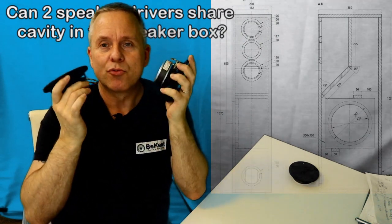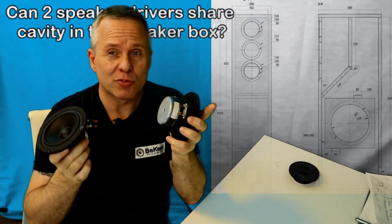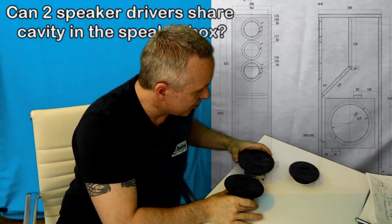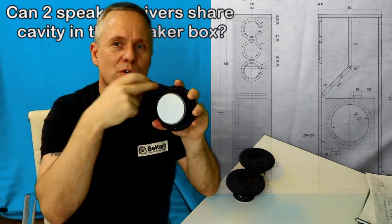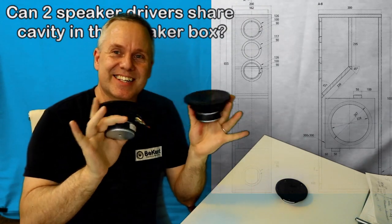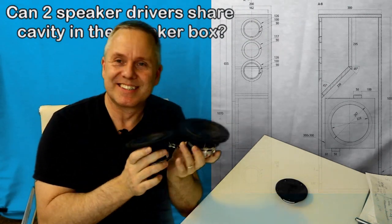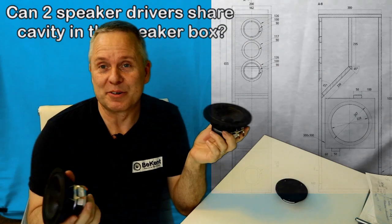So to wrap up: most importantly, if drivers share a room let them be the same model. It's really important not to mix woofers together, and if you're going to have a mid-range and a woofer, the mid-range must be covered so the woofer doesn't start driving it. If you have a tweeter, which is typically no problem, you still need to check the back and see if there's a cavity going all the way in — you can experience that on some ribbon tweeters. I think that covers how to decide which drivers can go together in the same cavity. Take care — comment below if you have questions or ideas for a new video!